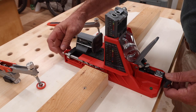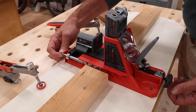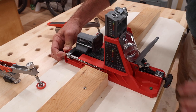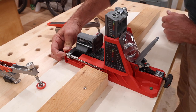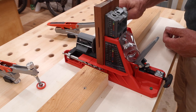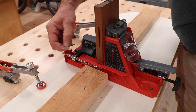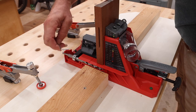To set the depth of the pocket hole, you'll hold the back of the drill bit here — otherwise it kind of falls out. It would have been nice if this snapped into place, but if you pull it forward, you're drilling a shallow hole. If you push it back, you're working with thicker material and drilling a deeper hole. To set the depth, you put in the material you're using — this happens to be 3-quarter inch material. I'll pull the jig forward, lock it in place, and then use the wrench that's attached to the side of the jig to tighten the stop.